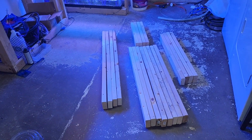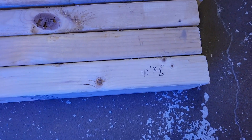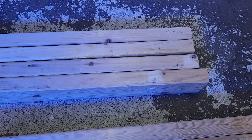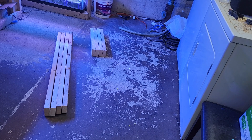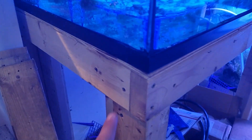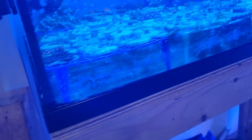So I figured I'd show everyone how I do it. Let's get started. To start, we're going to need some two-by-fours cut to size: four pieces at 48 inches, eight pieces at 40 inches, four pieces at 21 inches, and four pieces at 33 inches. We're going to start with the four 48-inch and the four 21-inch pieces and basically put them together to make two rectangles — a top rectangle and a bottom rectangle. We want to make sure we have the 21-inch piece inside the 48-inch piece, and we do that on all four sides.